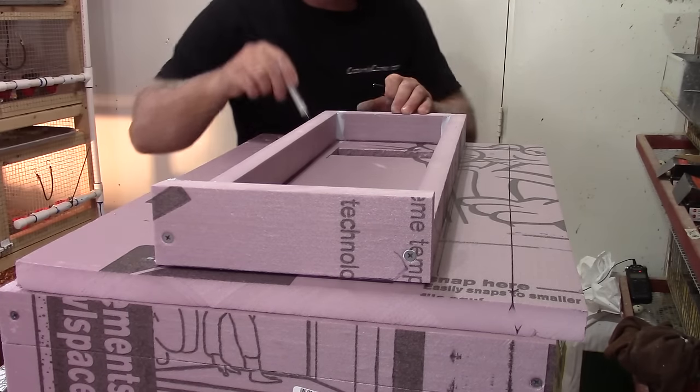I've got the rails cut out and ready to install. The top rails measure 18 inches by two inches tall. The bottom rails are also 18 inches but five inches tall — it doesn't really matter how high the bottom rail is as long as your eggs sit higher than the forced air intake opening at the bottom. The top rail sits 12 inches from the bottom of the incubator to the top of the rail — measure up 12 inches from the bottom and the rail installs on the bottom side of that mark. That gives you enough room between your bottom and top eggs.